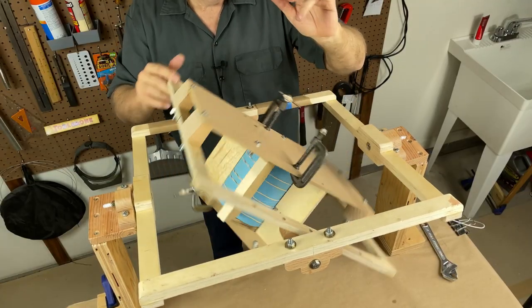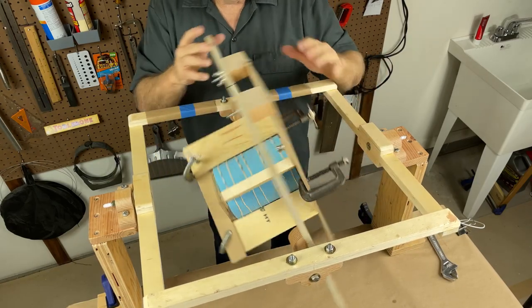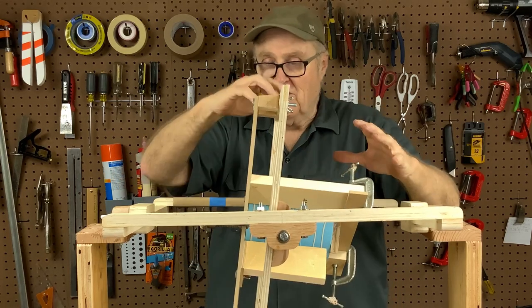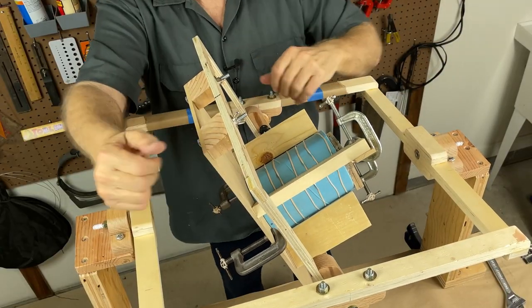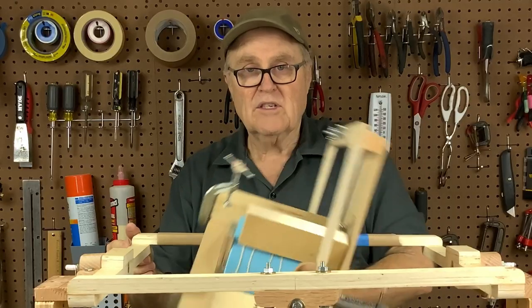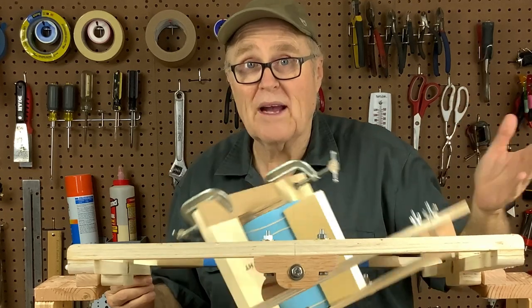When you're building your rotational machine, it's all about balancing — you do it in the design, but also at the end where you can attach clamps, weights, or all kinds of stuff. Then you just test it, and if it rotates with hardly any effort at all, your machine is balanced and you are ready to go.